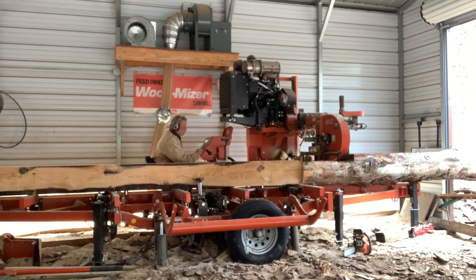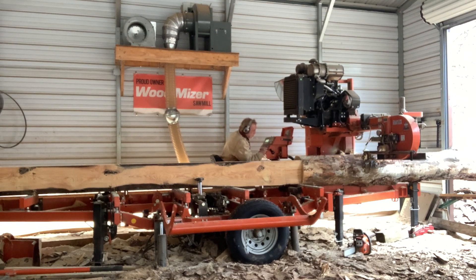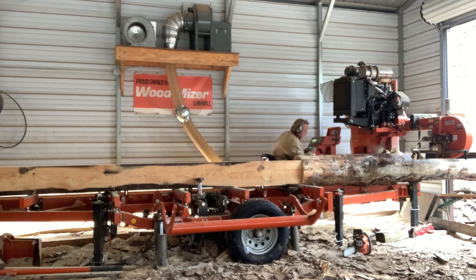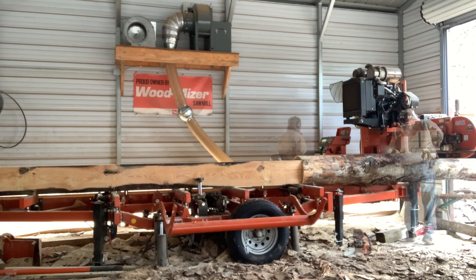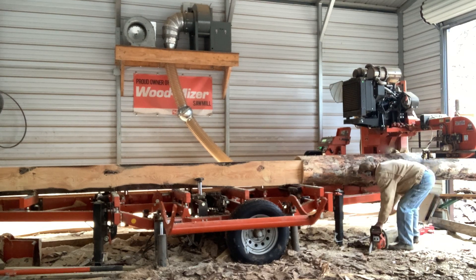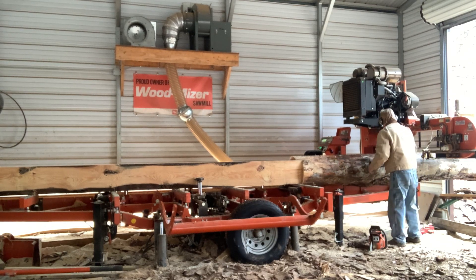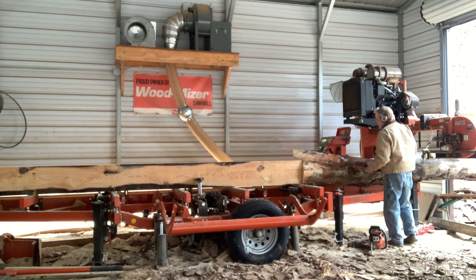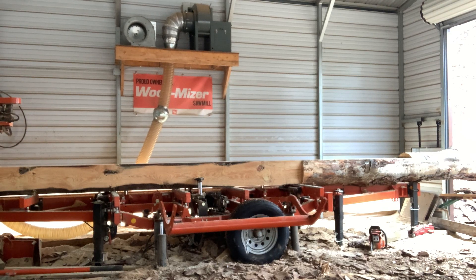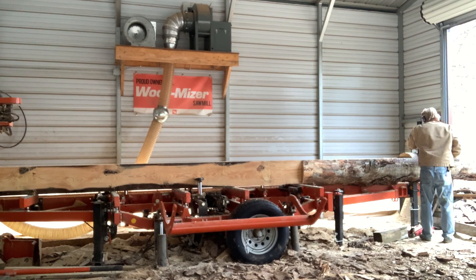Here I just dropped right back down. I remembered the dimension that I was at, made sure to do that, and I just drop right back down to it and finish the cut. As long as it's sitting on those bed rails the length of the sawmill towards the operator side, I know I'm still making a good straight cut on it. Here I'm cutting off that little short section, get it out of the way, and we'll be ready to roll the log over. Like I was saying, you have to just keep rolling it all the way around until you get all this cant dressed off.